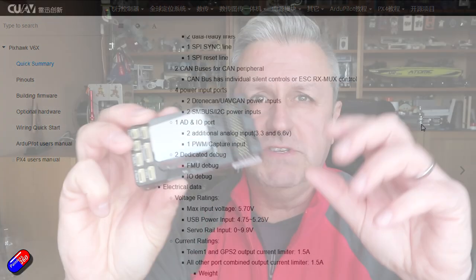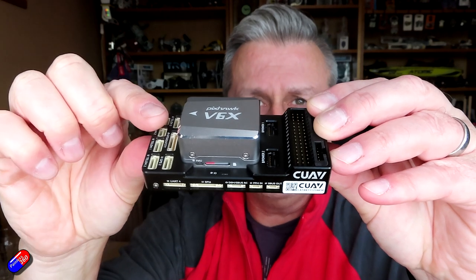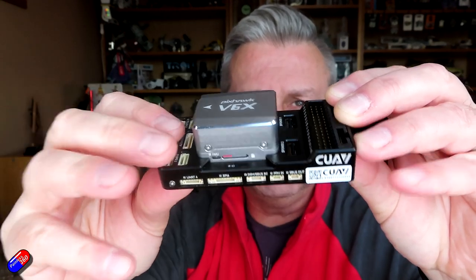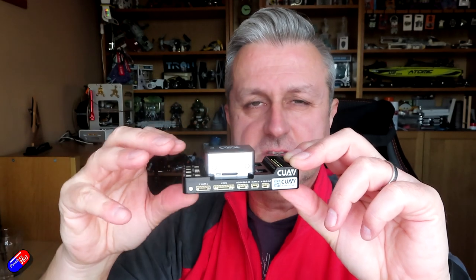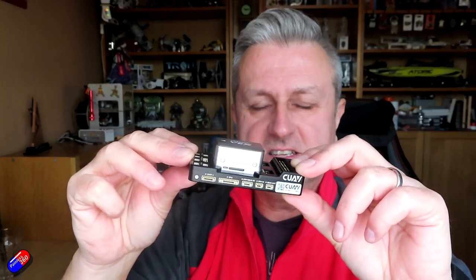It even has a little heating element inside. The actual flight controller itself is inside this little silver box, and this is the carrier board — the one with all the connections on. There's even a little heating unit in there. Why is that important? You get something called temperature drift. The IMU, or the gyro accelerometer, might think the board is sat perfectly level. However, as the electronics warm up, that changes the resistance, and the board may then think it's in a slightly different orientation. Having a heated element means the temperature inside the flight controller can stay constant. That kind of thing just isn't available on things like Matec and Omnibus flight controllers.